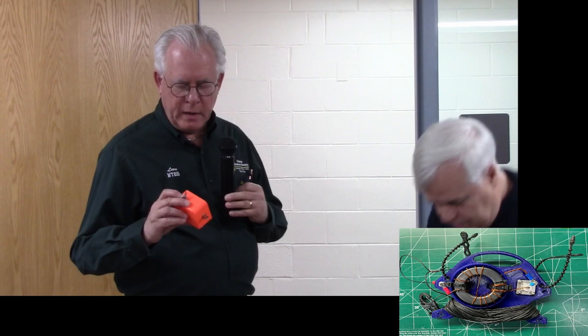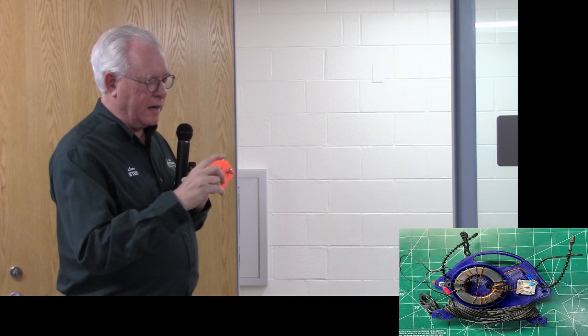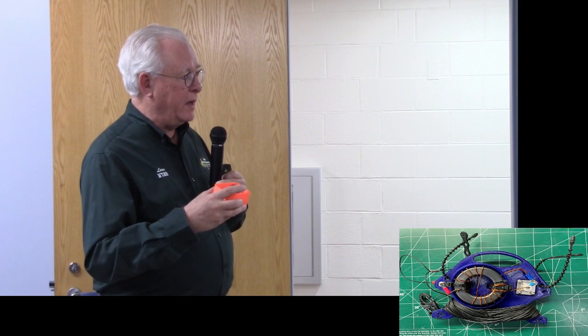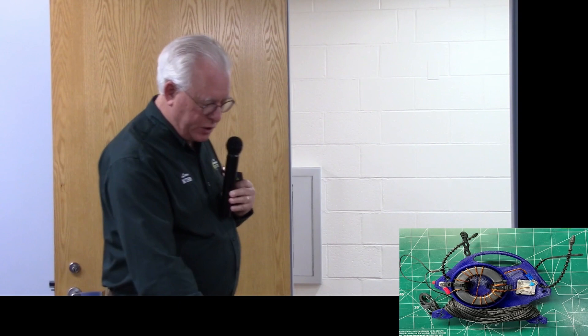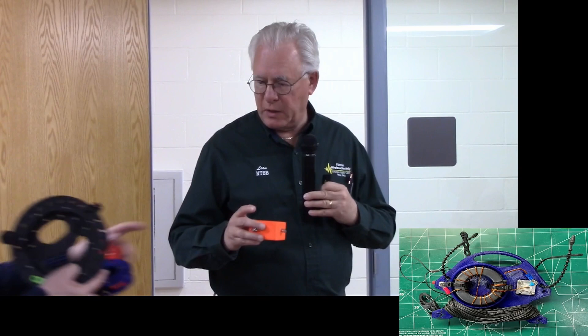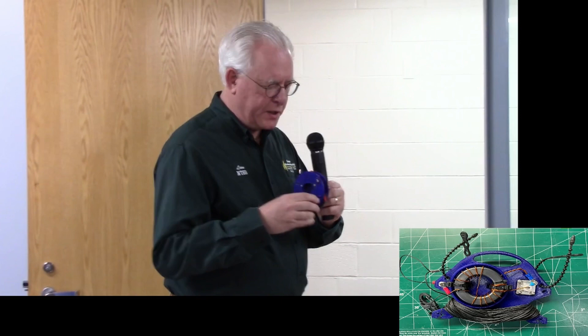For the vertical antennas, I put the transformer in a small 3D-printed box, labeled with where the antenna hooks up and where the feed line goes. I attach a 20-meter wire to the top of the 10-meter mast and run it up, and the box just sits on the ground at the base of the vertical — it operates on 20 meters or, if I pull the link, on 15 meters as well. I also printed a little winder to hold the feed line when used with the little box; I just unspool it and attach it to the antenna, and wind it back up when I'm done.